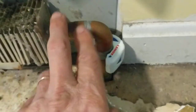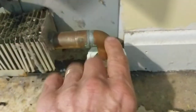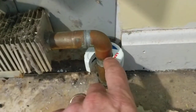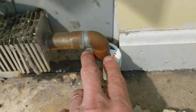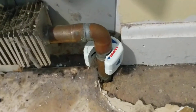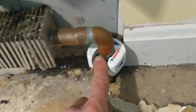If I was going to reuse all of this and had a bleeder valve on it, I could possibly heat it and melt the solder because any water inside could escape through that valve. But in this case I'm not planning on reusing this and I don't have a bleeder valve, so I don't have that option.